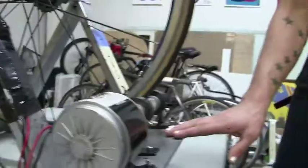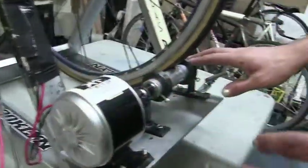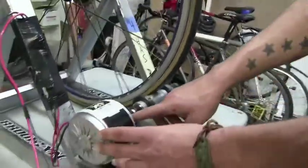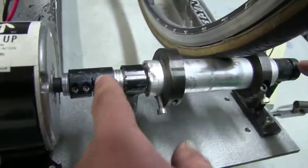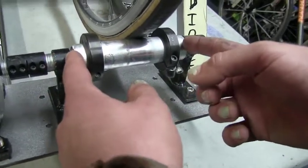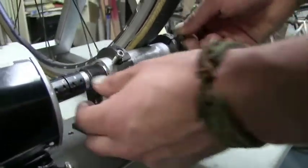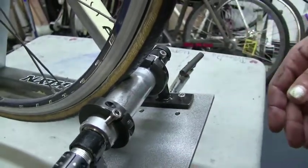The movable flange is key, even if you use a no-weld model, because you need to attach a motor to a roller that makes direct contact with the tire. The way that we did this was we attached the shaft that comes out of the motor to an automotive coupling to a longer shaft, which passes through two bearings in these bushings that we welded, between which we have a roller, which makes direct contact with the tire. The roller is held on to the shaft with set screws. It's a fairly simple system.